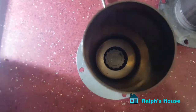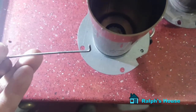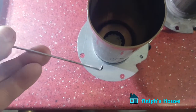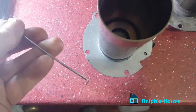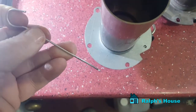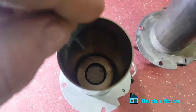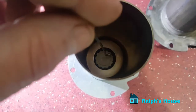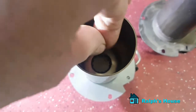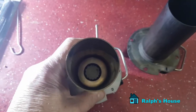I made this little tool — it's one and a half millimetre solid steel. The reason I use it is because it allows me to get in past the side and twist it. These burners clog up right down there, and that's what's causing the E08 error.